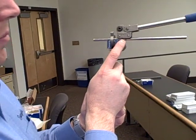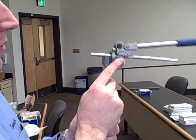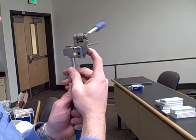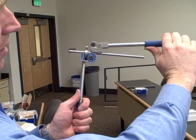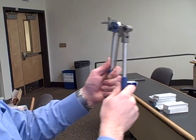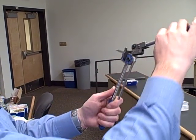Your mark will be under the L — we're working left to right — and you're going to take your bend off the zero. As we make the bend, you're going to take this down and remember the spring back, you're going to go just past it and eyeball it.